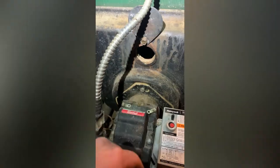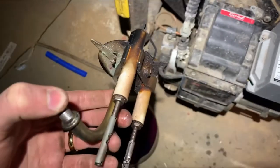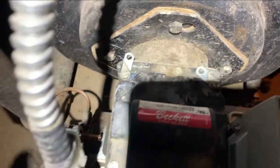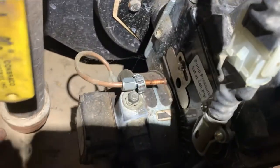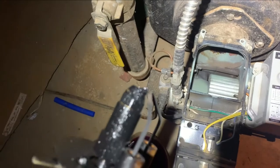To take out the electrodes and nozzle, you've got two screws. You loosen and move those tabs, take those two screws off, unscrew the nut, and then this nozzle just slides out. As you can see, the nozzle is very dirty, and there's junk real close to the electrodes too.